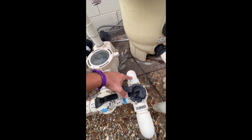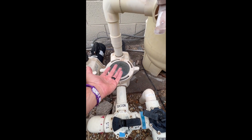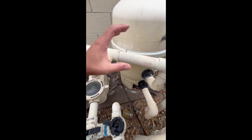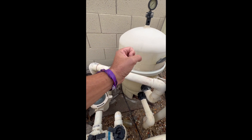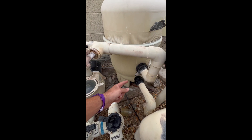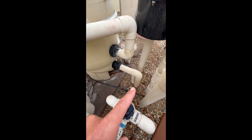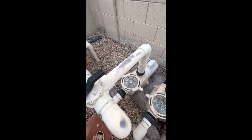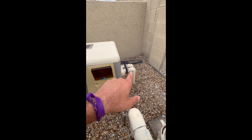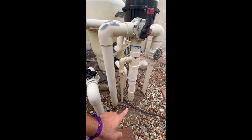So you're causing the pump to pull more water through your vacuum. It gets pulled through here, into your pump, out of your pump, now going into your filter. As it goes through the filter, there are four cartridges in there. Water goes through the cartridges, captures the particles, and comes out this pipe. This is where it gets kind of tricky — the pipe actually goes into the ground, underground into your heater, heats up the water, out of the heater, back down the pipe, underground.